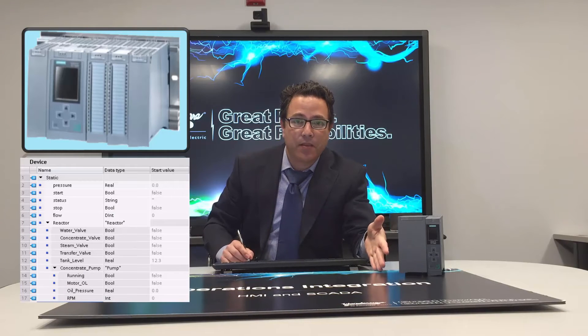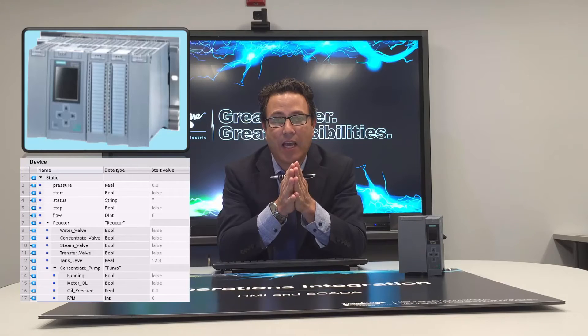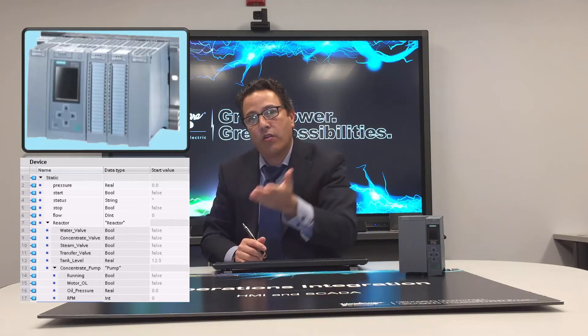You are ready to use the server within literally maybe a minute or so. Our integration with our offerings is obviously great, first and foremost with Application Server and System Platform. About a year ago, we introduced the concept of IO auto assignment. One of the key benefits of this particular controller, the S7-1500, is that it supports the symbolic namespace — a new offering which many manufacturers are coming out with, also sometimes named user data types. Instead of using the typical register-based addressing scheme, which is still supported, now you can use the symbolic namespace, which is a hierarchical name structure.